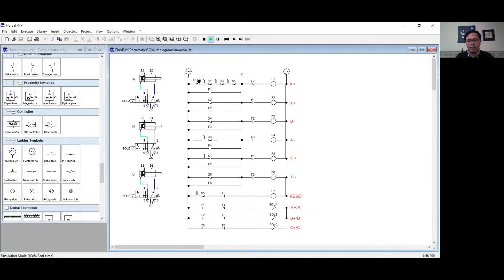In the description, when we press the start button, this sequence must be achieved. That would require that S1, S3, and S5 are triggered before pushing the start button. This will trigger a latching condition for when A+ is activated and F1 is closed.